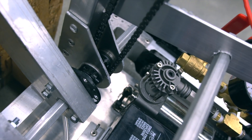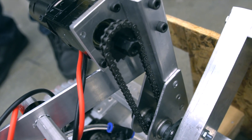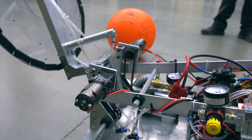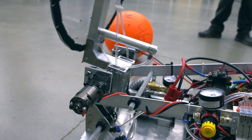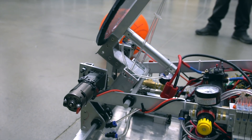The next mechanism we worked on was the hatch, and it wasn't anything major — just a bunch of minor touch-ups. One touch-up was changing from a fixed gearbox to a sliding gearbox to power the chains, to accommodate chain tension — one chain being a bit too loose. The sliding gearbox lets us tune each side independently. We also added a hard stop for the hatch mechanism to avoid hitting the cargo mechanism and electronics on the robot.